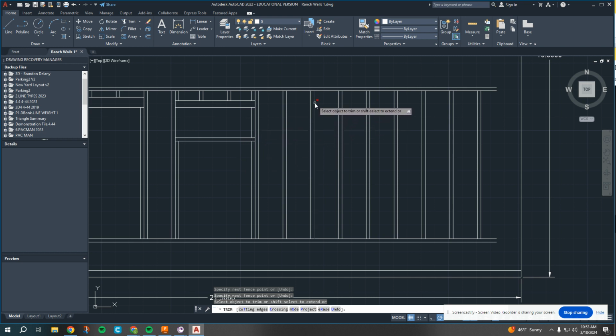Next window is going to come in here. So that measurement, again, I'm taking this off the paper, like you will have to at some point. 2.5. So it's going to be 2.5 inches up for the next sill plate. So we're just going to count 2 studs over, go to the right side of it, 2.5, enter, and then this is going to go through 1, 2, 3, 4, and then hit the 5th, like that. Big wide window.